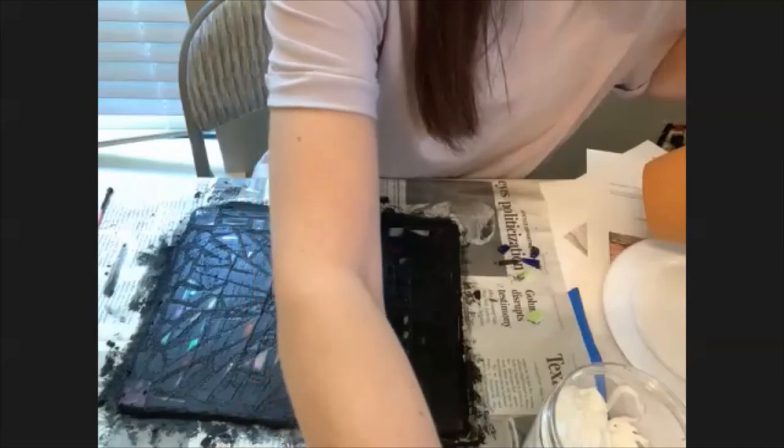Then you're going to get a dry paper towel and lightly wipe off any more excess. Then a damp paper towel. And that's where, if you have little holes in your grout, you can kind of manipulate the grout a little bit. But what you're really trying to do is get the grout off of the glass. And there'll be what they call a haze, sort of a residue of grout on it. But you let it dry. And then this next step gets all the grout off.